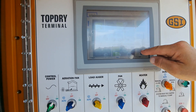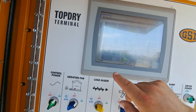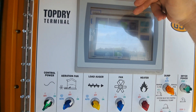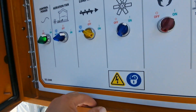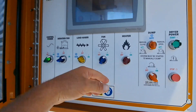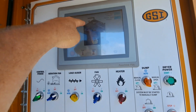In setup we're running on/off because it's warm outside. If it's warmer than about 70 degrees outside we're going to run the burner mode at on/off. We're going to run our burner differential at one. Auto flow is enabled — we're running auto flow and time-and-temperature in this system. When you start this system you would always fill it, then go to auto, then start your aeration fan, drying fan, and heater, and then it dries the way it's supposed to. When it reaches temperature it dumps for 24 seconds, closes the chutes, and whenever the grain drops off the fill switch it starts refilling again.